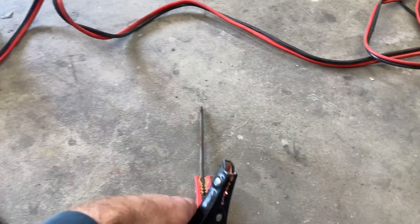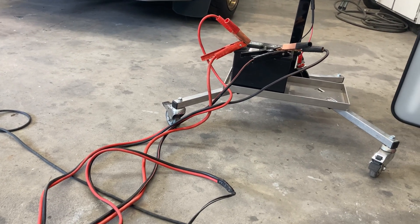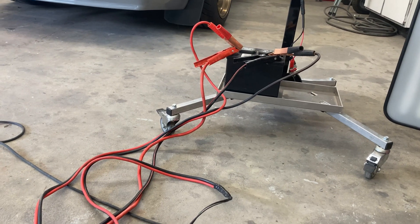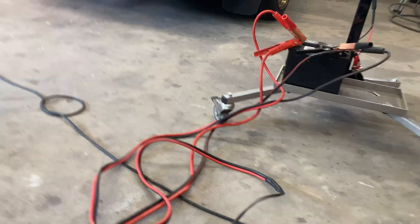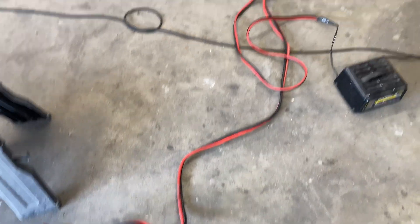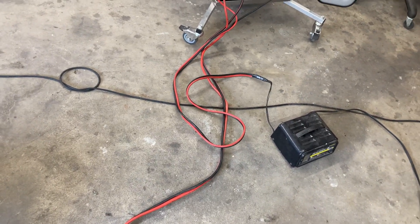You can see I've just got a metal rod here. That battery fully charged is going to burn the paint really really quick, so you need to get that battery down to about five or six volts and then keep the charger on it — just a trickle charge — basically trying to maintain that six or seven volts. That seems to be the sweet spot, at least with this setup. It all varies depending on the wiring size; bigger wire obviously is going to carry more current. You just have to play around with it until you get it where you want.